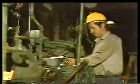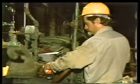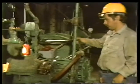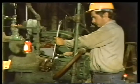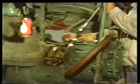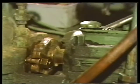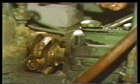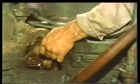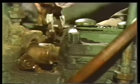To make loosening the gland follower bolts easier, spray the bolts with penetrating oil. The oil will dissolve any rust or corrosion that has built up. Then use a wrench to loosen the bolts and back them off far enough so you can swing them out of the way. You can now remove the gland follower itself. Pull it back toward you until it's free of the stuffing box, then separate and remove the two halves.